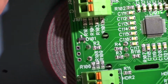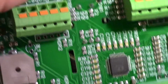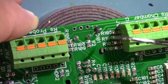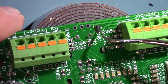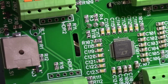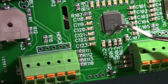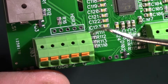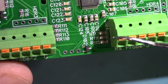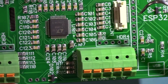I know it says D. I'm using it as a diode. In case you're wondering, it's one of the temperature sensors on transistors. Internal resistance varies with temperature, and I'm using it as the onboard diode. If you've watched my videos before, you probably know that already. These got pretty close, but that has something to do with my layout. All right, everything looks good.